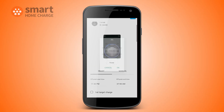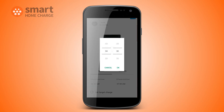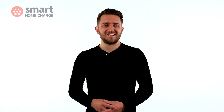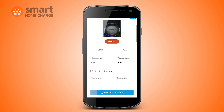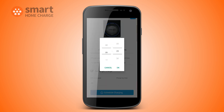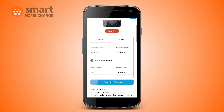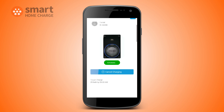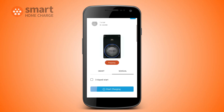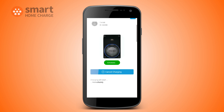The Sync EV app has what you'd expect from a modern smart home charge point. You can set up a schedule with a start and a stop time, and that's handy if you have cheaper electricity prices overnight for example. Simply set the start and stop time to coincide with the off-peak time. You can go one step further and set a target charge. So if you want a certain amount of energy adding to your vehicle, for example 25kWh, by a particular time like 7am, you can do just that. With this setting the Sync EV will try to meet the target within your off-peak window if you have one, but it will also charge outside this time to ensure that your target is met. Or you can strip away all those features and set the Sync EV to basic mode, so when you plug in the car starts charging immediately and only stops when it's full or if you manually tell it to do so.